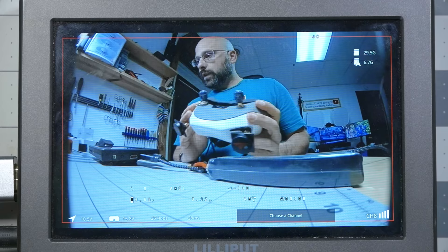There are two things that they unlock. One is the full eight channels, which most people are going to do. The other is the 1200 milliwatt hack, which raises the maximum output of the VTX from 700 milliwatts to 1200 milliwatts. I'm going to talk a little bit later in this video about why I don't actually recommend you do that at this time. Now that we've done that, if I hit the menu button you can see I have all eight channels.